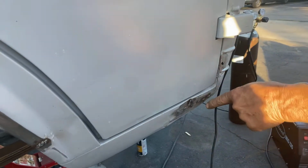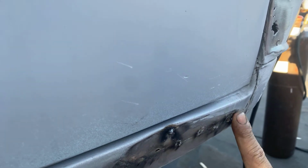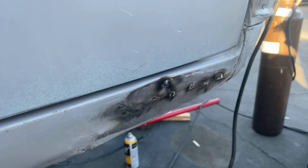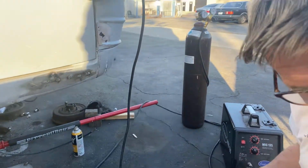If you get a close-up, you'll see that I didn't cut the truck. I cut the weld. I left part of the weld on there, right? Now all I got to do is smooth that weld down with the other disc from the grinder. Hope this thing won't turn on when I'm changing it. It's a nasty little machine to have a mistake with.